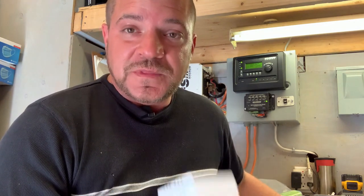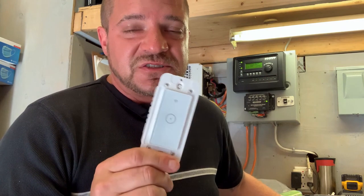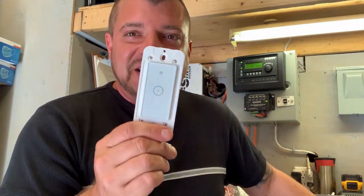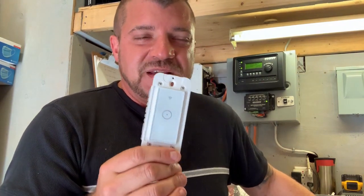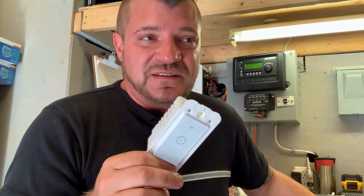The problem is if you start doing a whole smart home, it's going to slow your Wi-Fi signal down quite a bit. I noticed when the kids are on their tablets or phones it slows right down. What I ended up doing was buying a second router and linking all the smart equipment to that router so it wasn't slowing down my main Wi-Fi. If you're adding a number of smart switches, it's important to get a separate hub or router. Different brands have specific mini-hubs, but that limits you to one brand. A general router lets you link pretty much anything you get online to it.